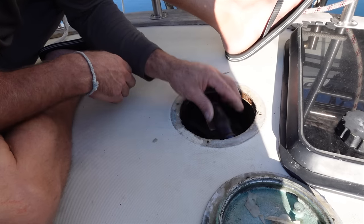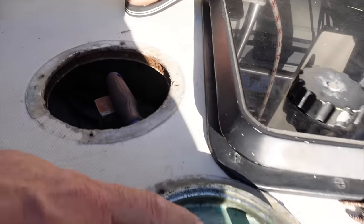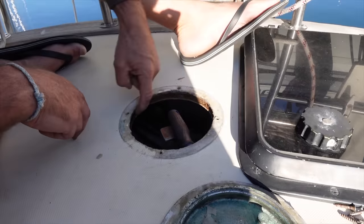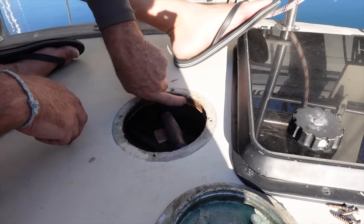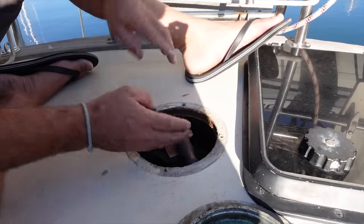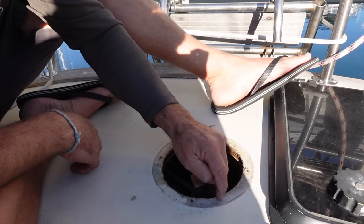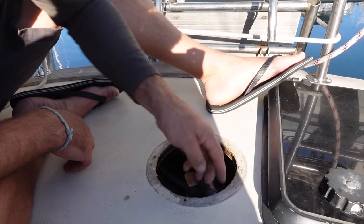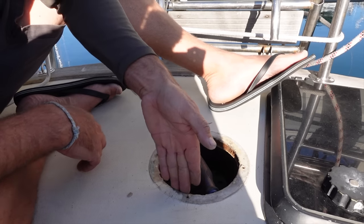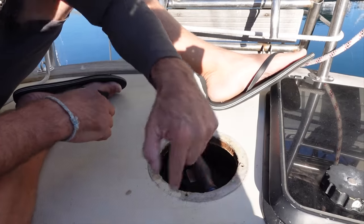The worst of it is obviously here. You can see where that screwdriver just goes in, and that's back to our soft spot. This is pretty solid here, but I'll remove all that as much as I can until we hit solid timber. Scratch all that out and then we'll pack all thickened epoxy in under here. I may even drill another hole right here and just put a liner of epoxy, syringing it in and filling up this little wet spot.